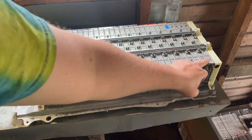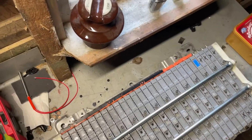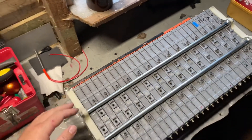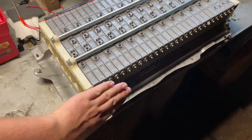These last four cells have gone bad, but I'm going to put them back in — not connect them electrically, but just so I can use this clamping system. I've got the backside connected up as normal and all the covers back on. This side is all exposed — it's only 14 volts between every second terminal, so it's safe to touch.